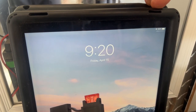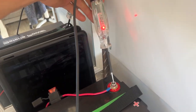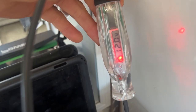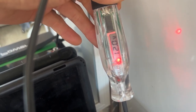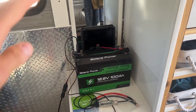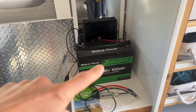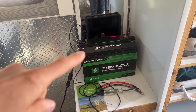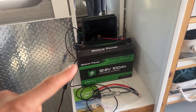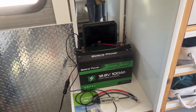It's Friday April 15th, 9:20 a.m., just about 24 hours from when we started the test. Voltage is sitting right at about 12 volts after running all day and all night — that's pretty good. On a lead acid battery, 12 volts means you're basically done, but the manufacturer said the cutoff for this battery is about 11 volts, so we're going to run it through day two.